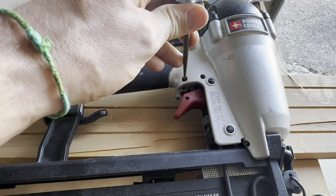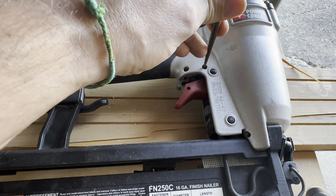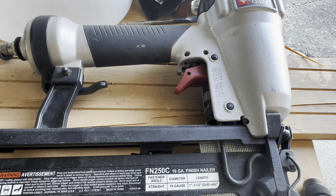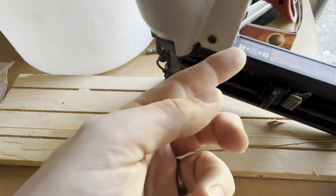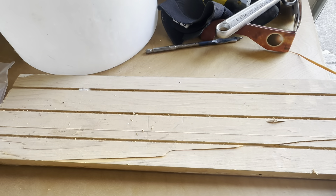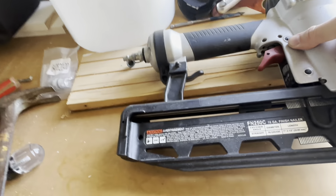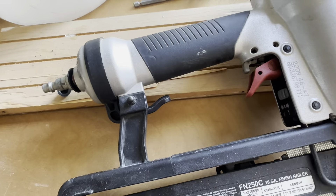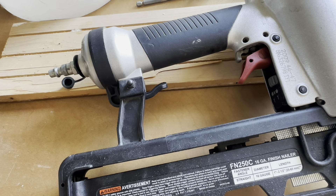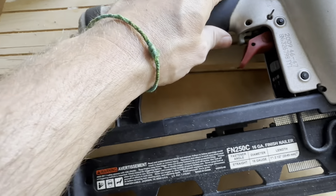Once they start moving in there — because they're going to be a little frozen — you're just trying to knock them through. Turn this over, you can see the pins are coming out. So we're going to take it the rest of the way through. Now that my awl is basically all the way through and it's not going to go any farther, I'm just going to use a small diameter brad nail to pop it the rest of the way.